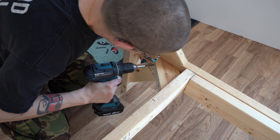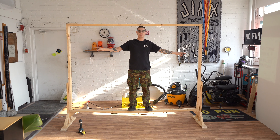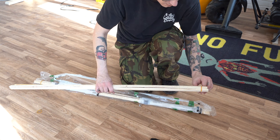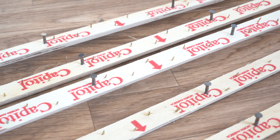Now's a good time to also blast some screws into areas of the frame that need more support. This will help minimize some of that shakiness. Don't forget to add a few going up from the bottom too. We're almost there — we just have to put the tack strip around the edge. You can find this pre-tacked carpet installation strip at most hardware stores. It comes in four foot lengths and has nails already inserted in it, so all you have to do is hammer it down.